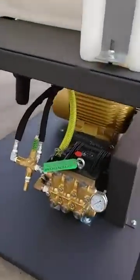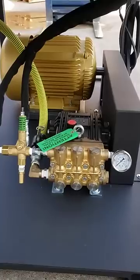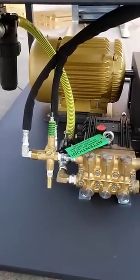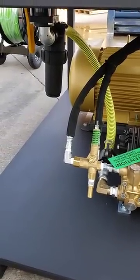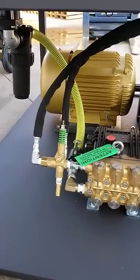On this end with the pump, we've got our standard secondary pop-off unloader valve for safety of the pump — for overpressurization and controlling bypass. We've also got a pressure gauge, a cam lock on the feed hose, and a water filter. You can shut the water off at the tank, clean the filter, and also drain to the pump.